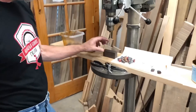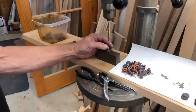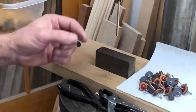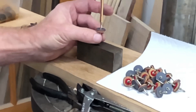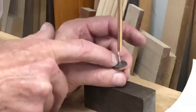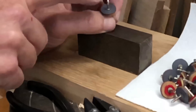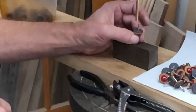Here on the drill press I have a steel block with a hole in it, and that hole is sized just a couple thousandths of an inch larger than the valve stem. Then I have a brass rod that also has a hole drilled in the bottom of it that is large enough to clear the threaded end of the stem. The hole is fairly deep but not deep enough to actually touch this valve seat — the lower valve seat. You don't want the rod touching that at all, so it actually hits the end of the valve seat before it can touch the ring on there.